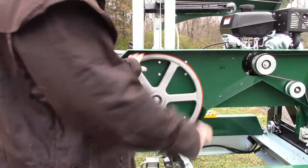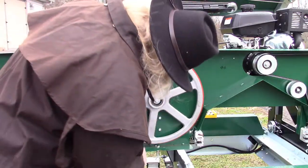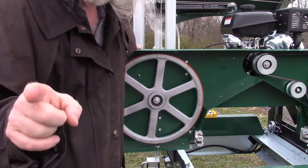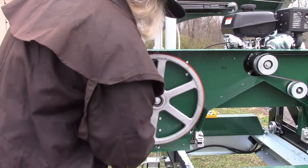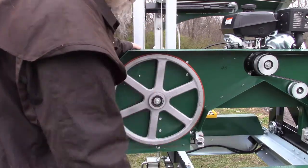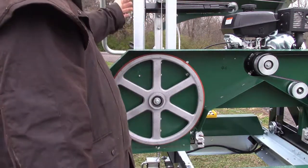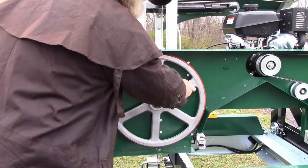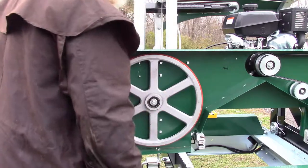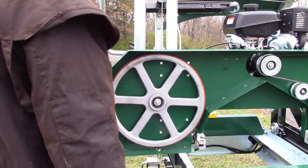We got a wheel. That side's square, and it runs fine. When this thing pops off, it goes off the back here. Whoever designed this thing so that it's got a nut right there, you owe me $50. Personally, you owe me $50. Because that's what the blade gets bound up on, that nut right there. I like to never got one of them blades out because it was so bound up on there. That's what breaks the teeth, where it binds up. Because there's a nut right there and the blade goes off the back. That's this wheel. Tilts that way, tilts that way. Moves this way when you pull that handle right there. Moves that way when the blade's tensioning it.